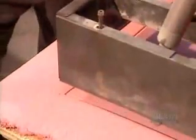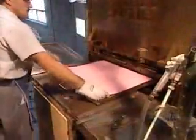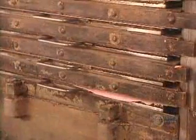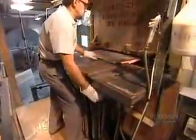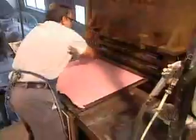When the rubber's ready, they cut out large squares, each weighing between 5 and 8 kilograms, depending on the thickness of eraser the client has ordered. The squares go into a steam-heated press to cure for about 20 minutes at 163 degrees Celsius. The pressure compacts the rubber, while the intense heat hardens it. They trim off the excess, then submerge the hot rubber squares in cold water to stop the curing process.